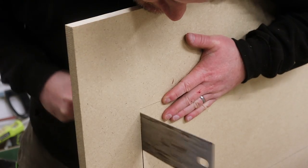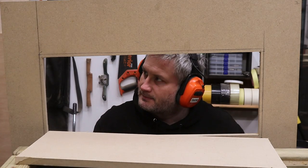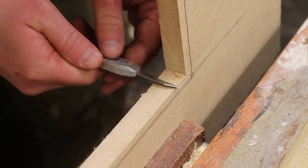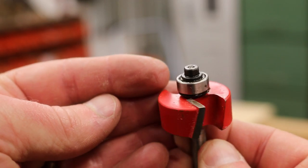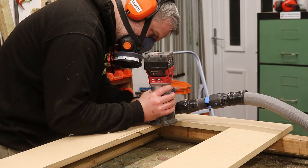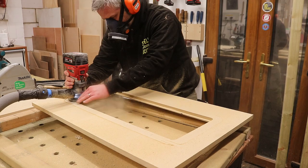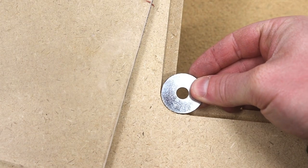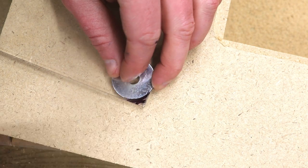I finish up the cuts in the corners using my Japanese pull saw and then clean up the edges with a chisel. I have a 9mm rebate bit for the router which I can use to cut a rebate that the plexiglass will sit in — so this is quite a router-heavy project in general really. I made multiple passes to get it to the depth I wanted. And using a large washer with the same radius as the corners, I can mark up the perspex and round over the corners at the disc sander.